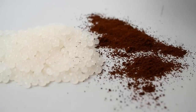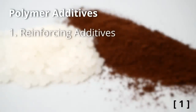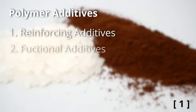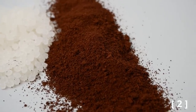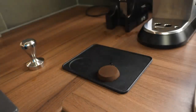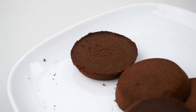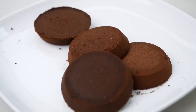But why add coffee to a polymer? Polymer additives can be separated into three groups: reinforcing additives like glass or carbon fibers that improve the mechanical properties; functional additives like plasticizers or impact modifiers, which act more on a micro or molecular level; and the third category, which are fillers. Fillers are usually cheap materials to add volume and reduce the price of the final product. Spent coffee grounds are a filler and may be actually pretty good ones, ecologically and economically speaking — economically because it's a waste product that is widely available, and ecologically because it reduces the use of polymers and pigments and as an organic filler might even improve compostability when added to something like PLA.